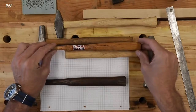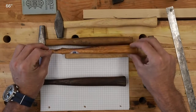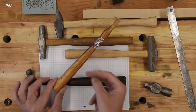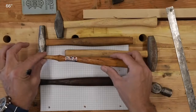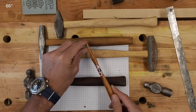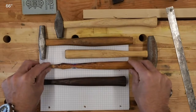This is the one I showed in the thumbnail — a really cool find. This is a very old Indian fire handle from Tennessee, made when they were crafting handles for guys who knew how to discern quality and expected the best. I think this is probably the high water mark. They put a varnish on there, burnished and burnt the handle. Little details like taping off the top so they didn't varnish where it goes into the head. Grain orientation is good. It's a very nice handle.